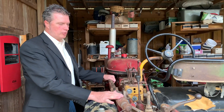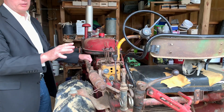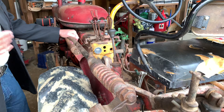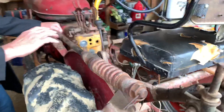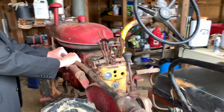What I was saying about this lift arm: this lock nut right here is very important. The lift on a 140 — at least mine, and I think most of them — they have down pressure on them. So when this thing is locked in and you're pushing it down, you're putting a lot of strain on this bar here.